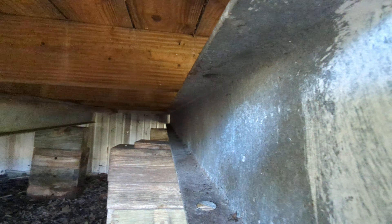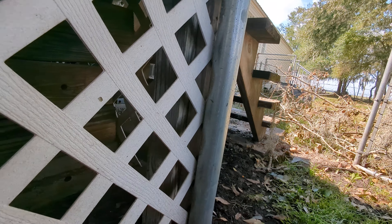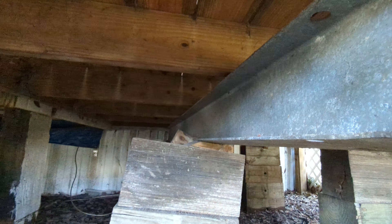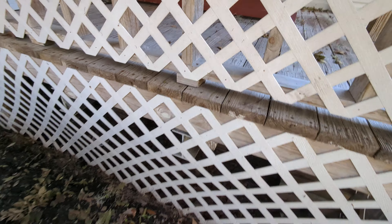There are some more I-beams here, and they're not even holding the whole deck up. The only other supports I see are in the corners — and that's it. So what I'm assuming is the addition flooring started to sag, and this deck as well, and they added these I-beams to try to help support it. But they're not even connected all the way across the span.